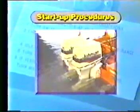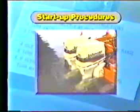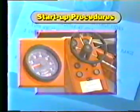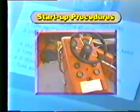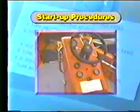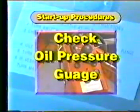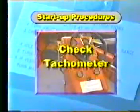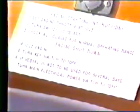When the engine starts, check for oil pressure immediately. Allow the engine to warm up at idle speed, but do not run at idle for more than 10 minutes. Shut the engine down if any alarms are heard. Make sure to check for normal operating ranges on the oil pressure gauge, the temperature gauge, the voltmeter, and the tachometer. The following is the shutdown procedure.